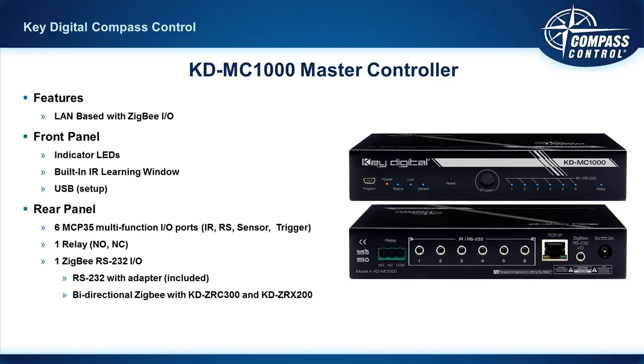The network port TCP/IP is, of course, how iPads and Android devices will communicate into the network to the KD MC1000. The iOS and Android device, as the brain, tells it in very small packets to execute an IR burst or RS-232 string out of ports one through six. Similarly, the MC1000 can actually execute commands and put those back onto the network through the network switch into the router — useful if you have a device that only supports a single active network socket at a time. That's a very nice feature of the MC1000.